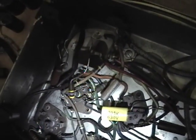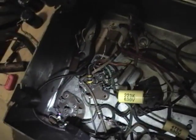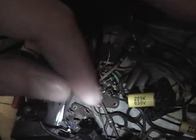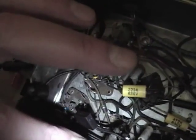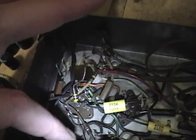I spent some time with mineral spirits, denatured alcohol, and q-tips and cleaned up the whole burned-out area from that capacitor that went up in smoke. It turns out that capacitor was directly from the AC line to ground — you're really supposed to use a safety cap there. What they had used was just a 250 volt DC cap, which is not at all up to code. So I've taken a proper safety cap and put it in its place, and I just have one corner left to finish — then I think we can try this radio out.